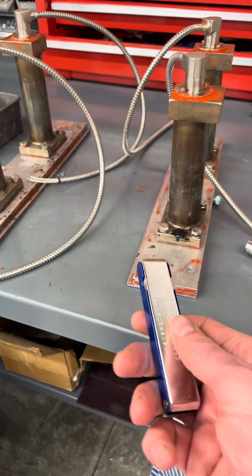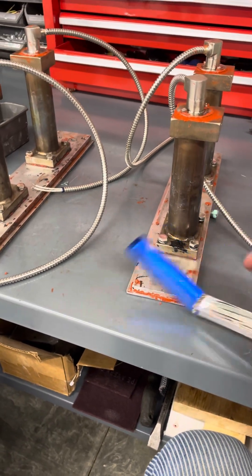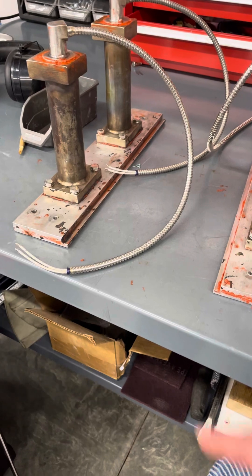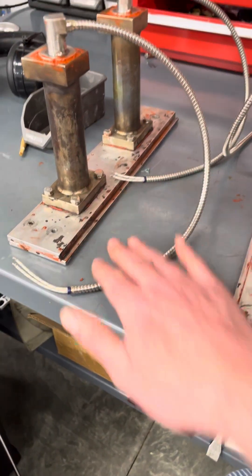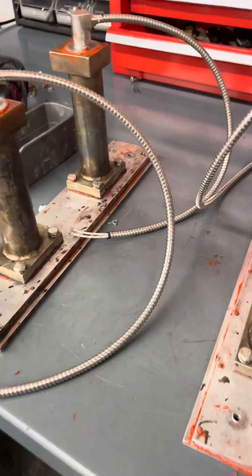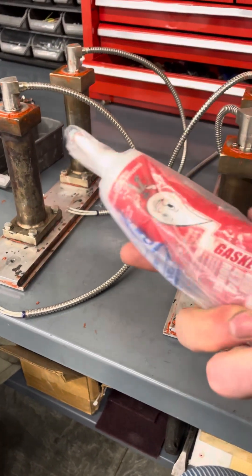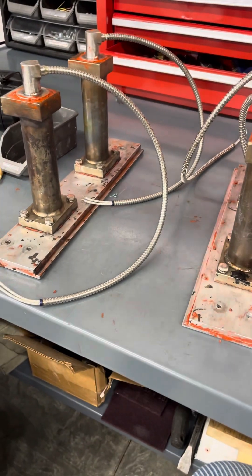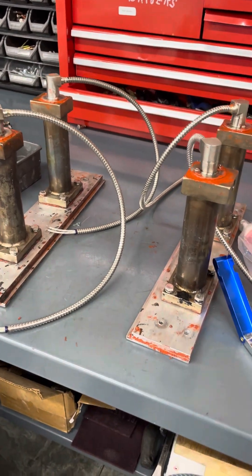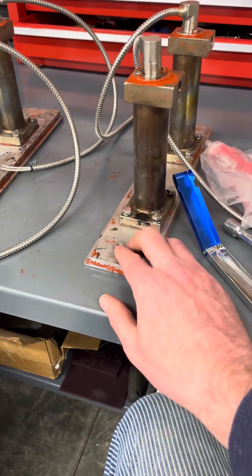Sometimes when you have these actually hooked up, you may want to get welding tips — skinny little wires you stick in these holes when you get carbon buildup in here that blocks it. A welding tool can be useful. And if you're starting to see that often, it's telling you you have a lot of carbon in here and that maybe it's time to take these apart. When you are taking these apart, the best way to break the connection between the red high-temperature gasket — 474 sealant — is twisting sideways. Do not try to do it straight. Same with these — twist sideways. These come apart way easier. Be very careful or you can bend these because they are aluminum.